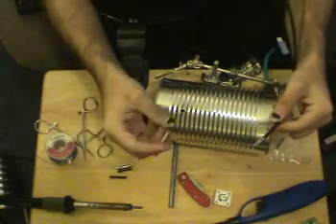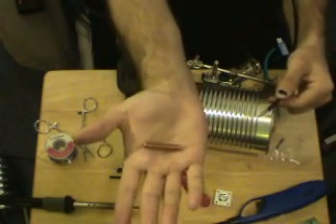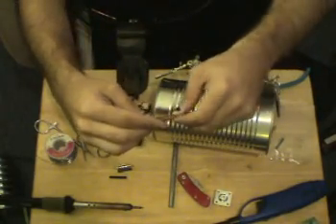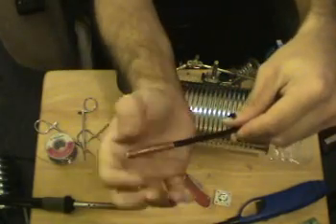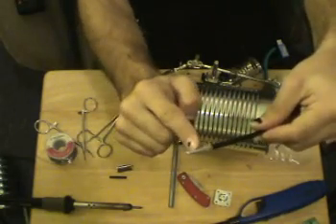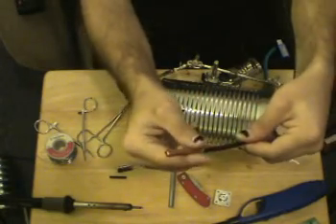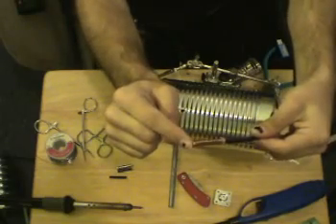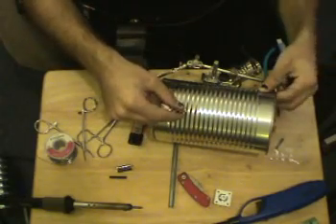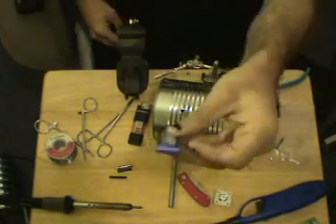What I'd suggest is getting some kind of metal pipe. This is copper pipe used for ice maker water feed lines — it actually fits quite nicely over LMR-195. You pre-tin the inside of the coax shield, solder your driven element onto it, and when you put it through, this pipe acts as a shield. Anything exposed from outside the pipe is your driven element, which will be soldered to the top of the can. For my thin coax, though, LMR-195 is a bit big for this little USB card.